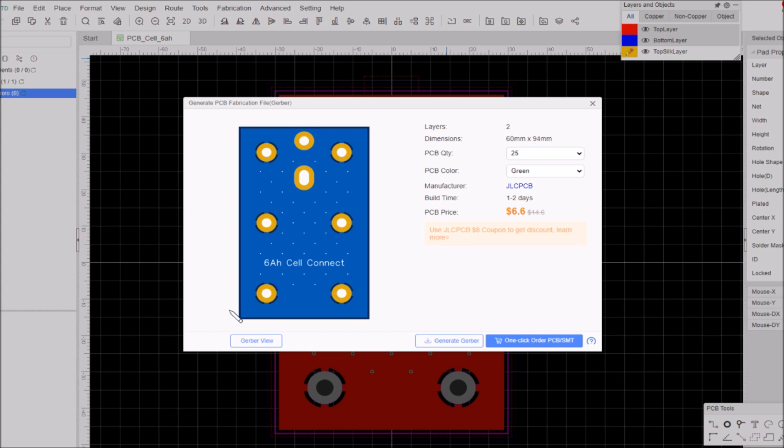Here's the board — it's two cells wide, three cells tall — and you can see I've got a couple of mounting holes here for the angle bracket, which means I can put banana sockets and terminal posts on there. I've done spoked holes for the cells with the idea that these act as fuses, though I've made them very large so they probably wouldn't work very well as fuses. You've also got to remember they're on both sides because this is a double-sided board, so all the cells are effectively fused into this back plane. I've also peppered it with vias to connect the two sides together at positions in addition to the through holes.